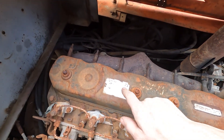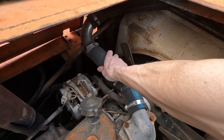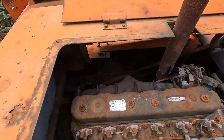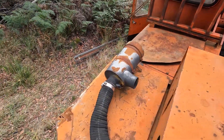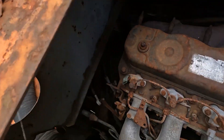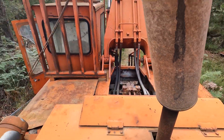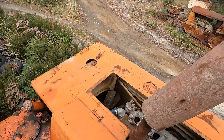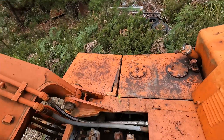These actually run an Isuzu engine — I'm assuming it's all original. Looks like someone's added some new pipework for the radiator. The motor did run quite nicely — it sounded good actually. I don't know if the air filter is blocked or there's a bad hose, but that's a bit sucked in there, might need a bit of attention. Whenever you move the controls, it did load the motor up a lot, which could be a hydraulic pump issue — but so long as it moves, I guess.